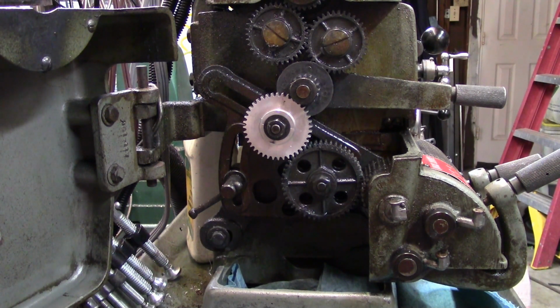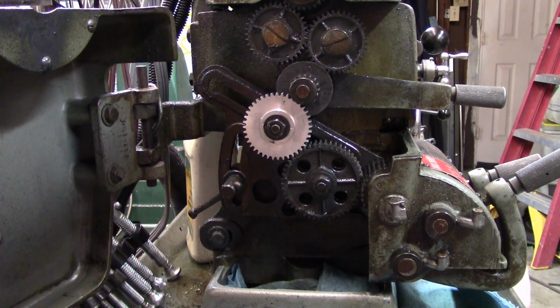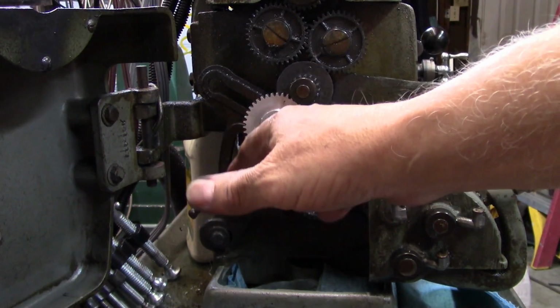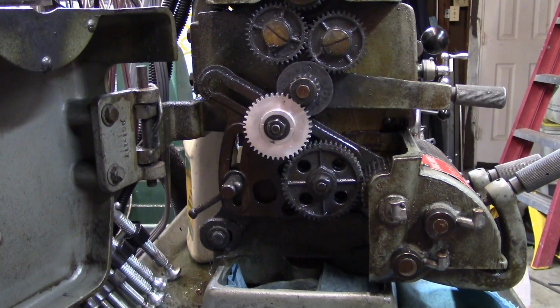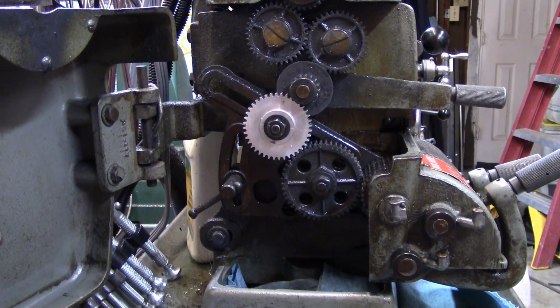Number one, I've got to figure out why my gear cutter seemed to wobble. When I first made the arbor, I put it on there and it ran just as straight as an arrow. This time I put it on there and it was wobbling, so maybe I got some chips under it. I don't know. Randy Richard wouldn't have used it there. He would have stopped. But I didn't stop at that point. I was too eager to make a gear, you know, so I went ahead and used it. And lucky for me, my dog wasn't real tight in the slot, so it would wobble back and forth with the gear cutter and, I guess, let the cutter have room in the gear. But anyway, that's a loose end to tie up.